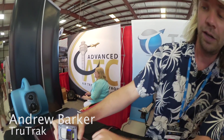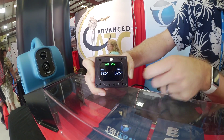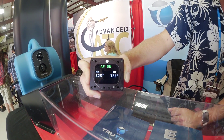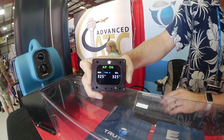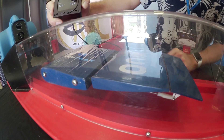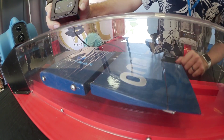Today let's talk about the new TruTrack Autopilot, Eco — a two-axis autopilot with automatic envelope protection. To engage the roll axis of the autopilot, we click the lower left-hand button. The autopilot engages and synchronizes to our heading or our current track, either one, depending on whether we have a GPS or not. You can see the heading changes as I move, and we're moving a fake aileron here using just this control tab.